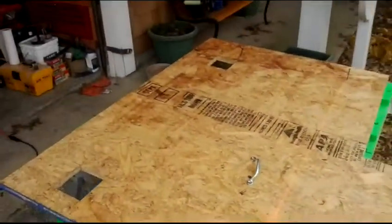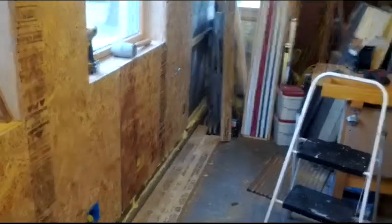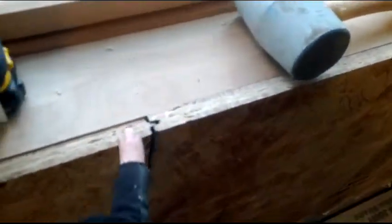It's time to set it up. Here it is fit — use the handle, pull it into place. This edge is the one I was paying attention to as I set it, so this is perfectly flush with the window sill. It's a little off in one spot — I'm choosing not to get crazy about it. For no capping trim, I think it's a pretty good fit; it's just a little bit proud along this edge, but by the time it gets to the end it's good again. I've got those two temporary screws set, and my electrical boxes line up okay. Now I'm going to start permanently screwing it in.